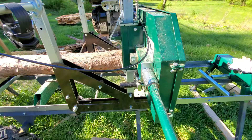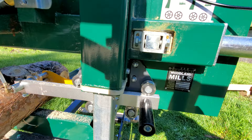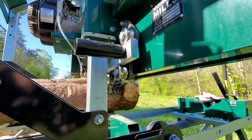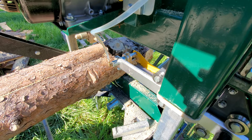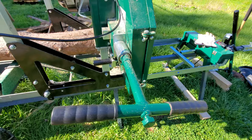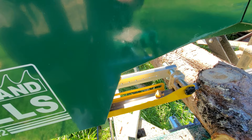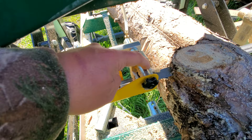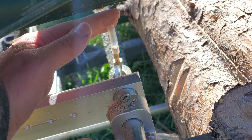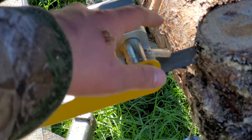Pretty easy to install once you figure it out. It just bolts on to where the old blade guide had set, and then you put the bearing blocks and stuff like that back on. You just grab it here and move it wherever you want. There are little detents so it'll stay put. There's a little grease fitting here — no ball bearing in it so it can just run out. I grabbed an inch of tube from the old setup and moved it, and that way the water gets on the blade.